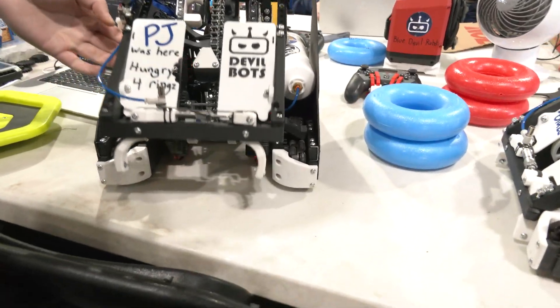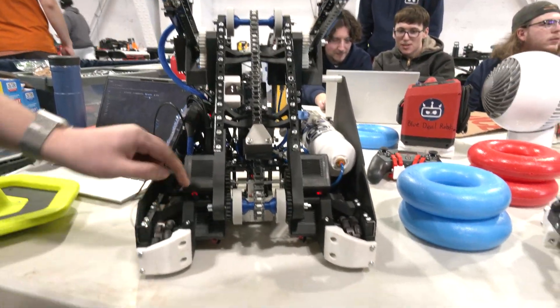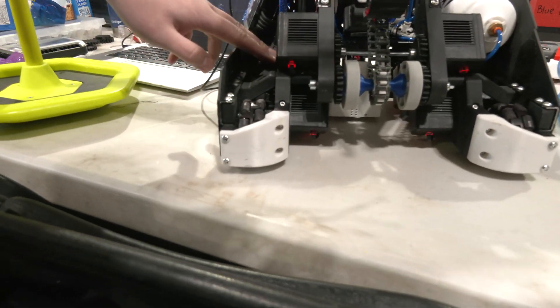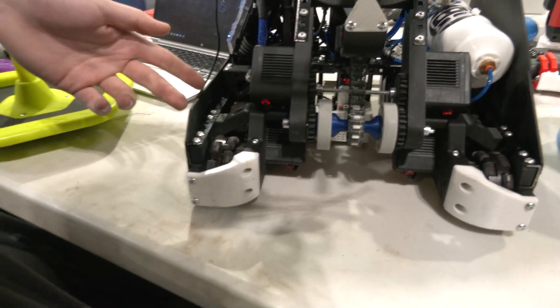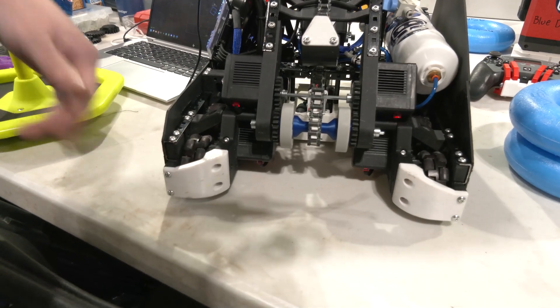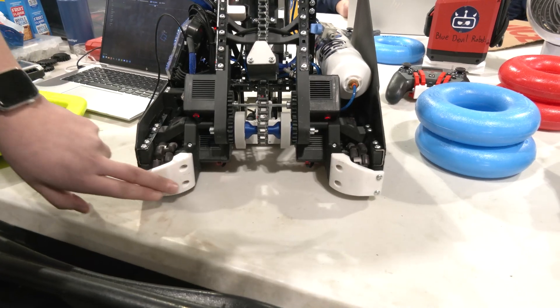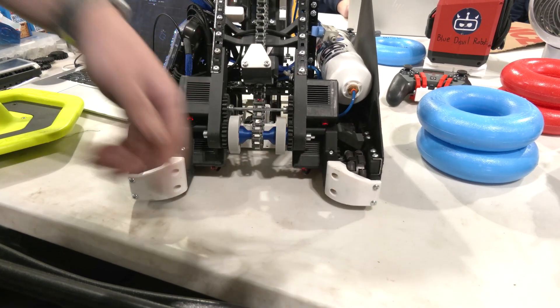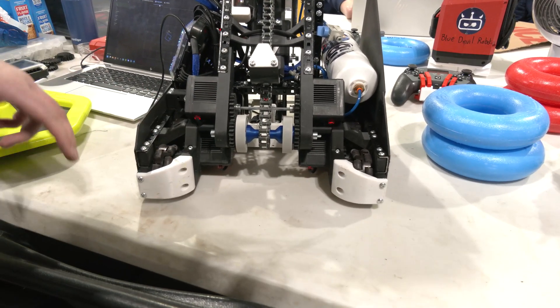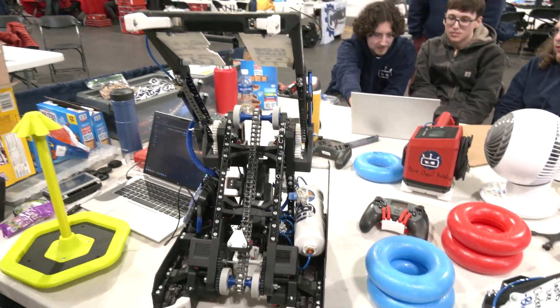The front of the robot, we have seen parts completely explode. These here we usually use draft PLA because we go through a lot — about 10 kilos over the past four months. But these ones are ABS because of how violent we are with this robot against the wall, against other goals, against other robots. These take a beating, but with ABS we're able to refine and swap out these components very fast, which is a simple screw set and it just goes right back on.